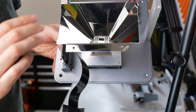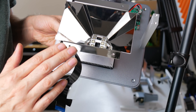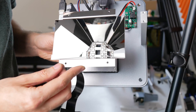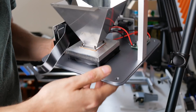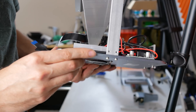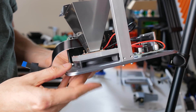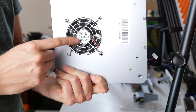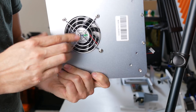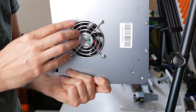It seems like a lot of people make a big deal about complicated LED arrays or doing something to diffuse that layer of light. I really haven't seen it make any difference on the quality of a print. The overall construction is nice and solid. You can tell they really optimized for the minimum amount of aluminum and CNC work necessary, but they did it nicely. It's really clean. The fan's a little loud — that could be something you change in the future. It's not bad by any means, but it's the loudest part of the machine. If you put a big 120 millimeter fan in there, like a Noctua, something quiet, that'd be pretty nice.